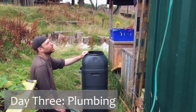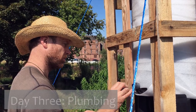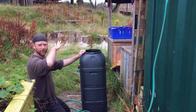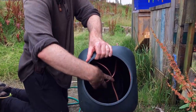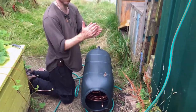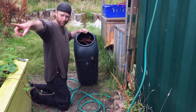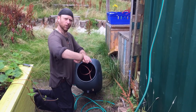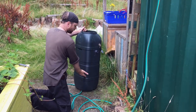Today we're going to be plumbing the panel to the tank and the mains to the tank. We're going to spray paint the front of the panel black when we cover it with clear plastic and then the system is done. So basically we just plumbed in the heat exchanger here. I've just got basic compression fittings going through the wall and then using that to clamp onto the wall. So the water is going to come from the tap through this hose, into the copper, go around the copper, come out of the copper. This is going to be full of hot water especially at the top of the tank because the hot water will rise up.